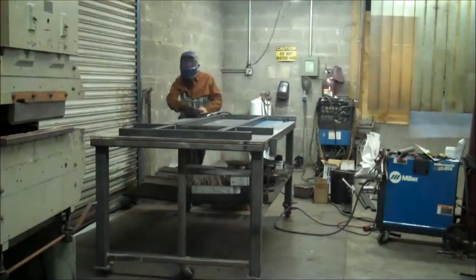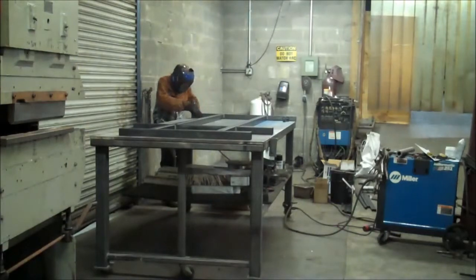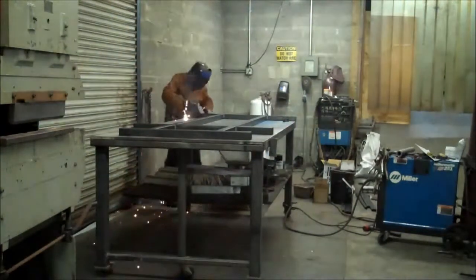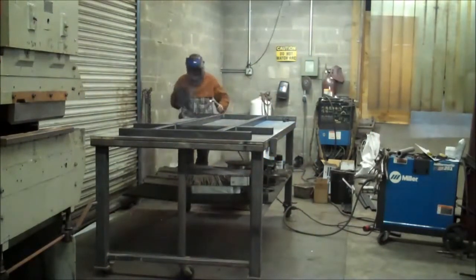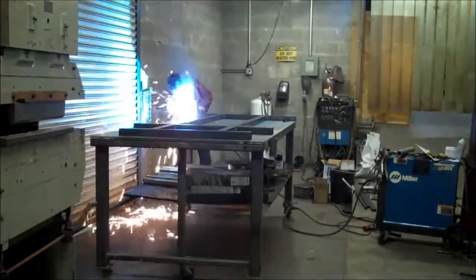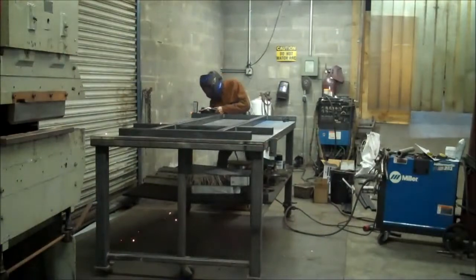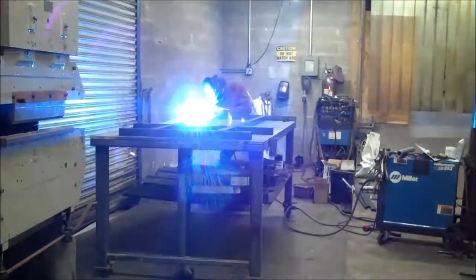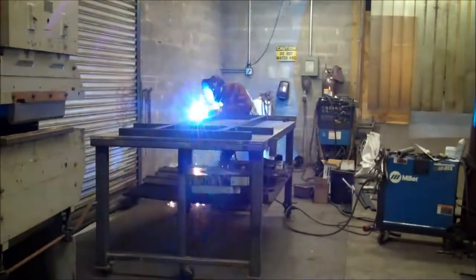Jeremy, how you doing? I'm great, Bill. Thanks for the introduction. There are many processes to complete the fabrication of the bicycle frame. We start by buying 2-inch steel tubing in bulk from a local supplier. Once material is received, the tubing is cut to size per the specs on the drawing. Each piece of tubing goes through a different process. Each individual piece has different hole locations for different mounting purposes, and this is done on our CNC machine.